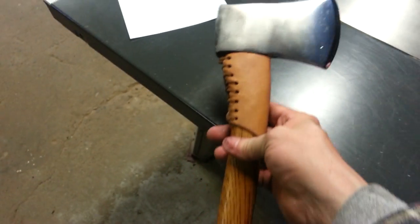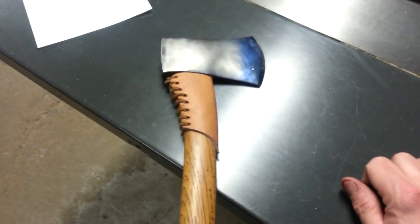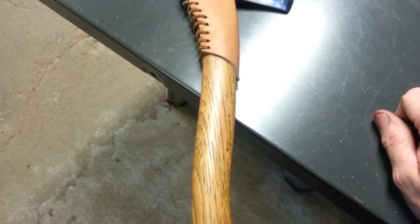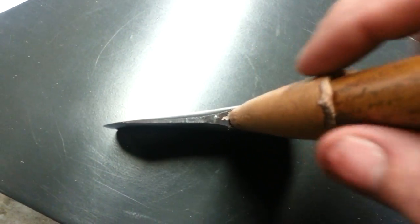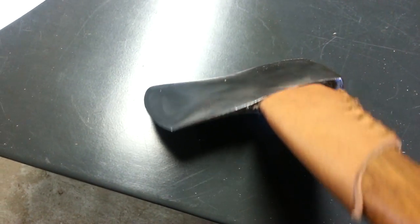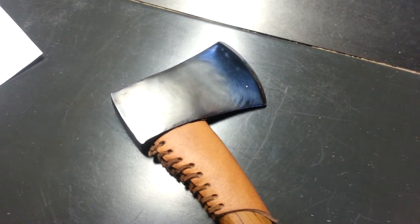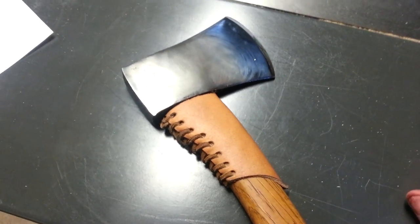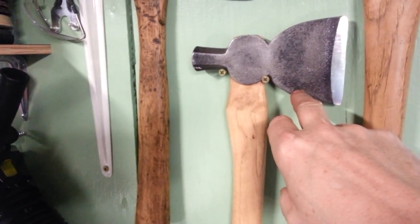Now this is a really old hatchet, probably from like the 30s. Original handle — I pimped it out a little bit and refinished the handle. When I got this thing, if you can see up here by the leather, that's paint. I left a little bit on there just as a reminder, to show people — this whole thing was covered in paint like that, which isn't good. It was used to chop open paint cans and anything and everything. Also what I did to it was I made it a single bevel right-handed hatchet, because for a long time I could not find one like this Keen Cutter or a good usable roofing hatchet.